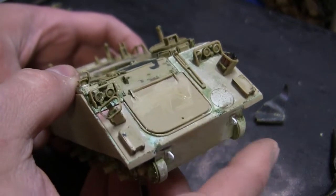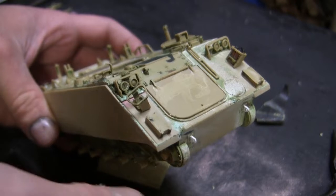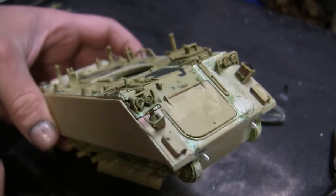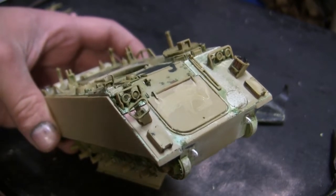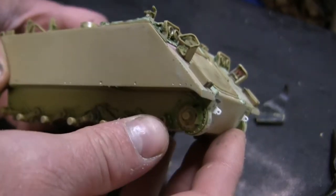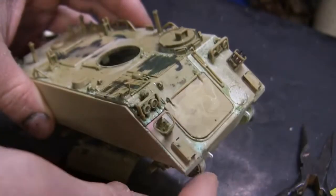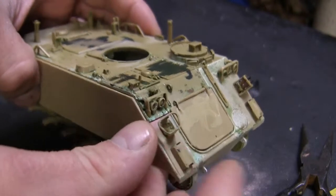Now, normally I would take the existing unit and make a mold out of it so that I can cast identical replacements. However, the unit wasn't really able to be salvaged. It was so encrusted with glue, and the piece was basically gone. So rather than going with the mold route, I simply replaced them altogether with two new units fabricated out of pieces of styrene.